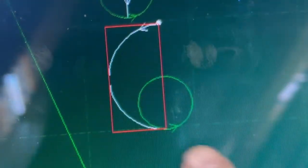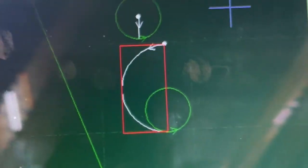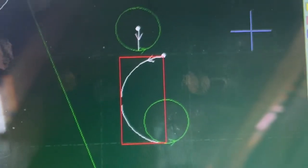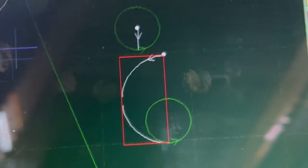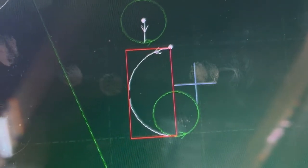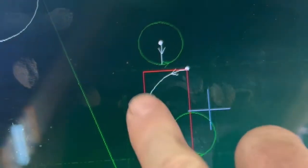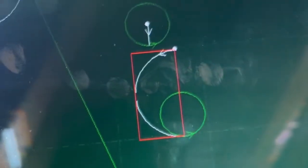Okay, so in the other video I was telling you about doing the lead-ins and stuff like that, and then I just clicked the select only. Well, here's a good reason, and I'll show you. I just made this happen so you can see how I fix it, just for simplicity. I'm sure there's many ways you can do this, okay? But that hole is a different size than this hole right here, okay? So this is telling me, hey, there's gonna be an error right here. Do you want that? So you always wanna zoom in on all your stuff and have a look, okay?